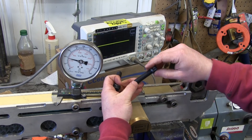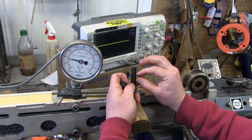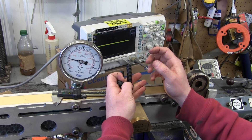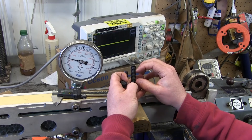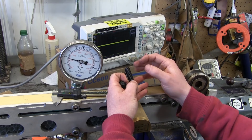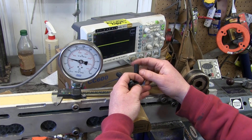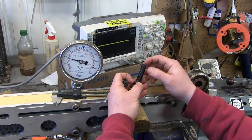Ultimately, what we're trying to do is jam that wedge in at just the perfect Goldilocks amount, so we get the correct stress in the material. That stress could be in a low grade bolt — 60,000 PSI — that's a lot of stress. Or in a higher grade, like an L9 or a grade 8 bolt. We're speaking in SAE here, not SI. The units might change, but the story stays the same.